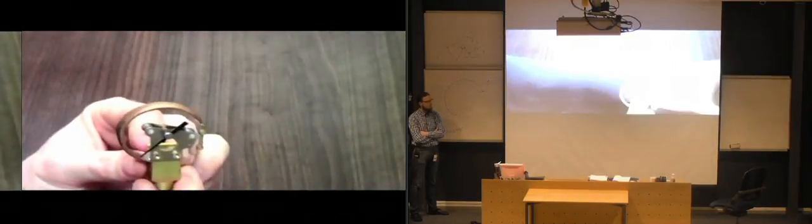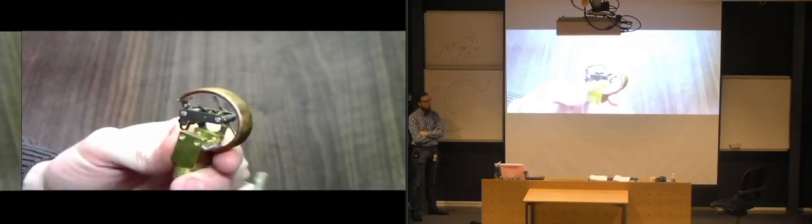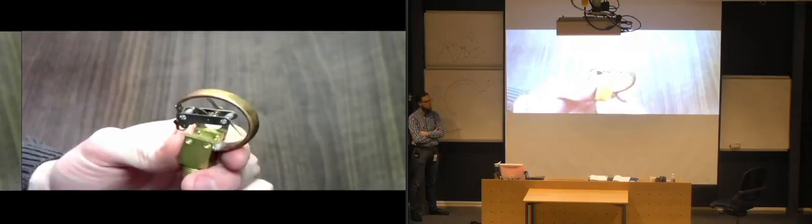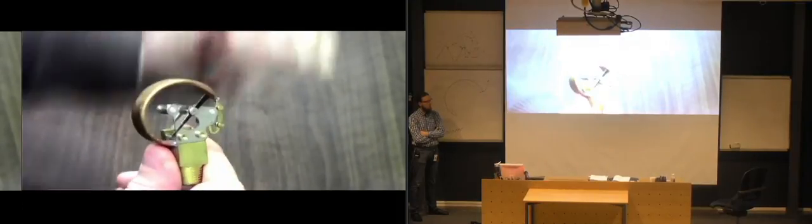For a real quick show, I'll show you the 2.5-inch dial, or this is actually a 2-inch dial. Just to show you, it's the same amount of parts, just a lot smaller, which makes these a little bit more sensitive than your more rugged, bigger dial gauges. And you still have your socket here, Bourdon tube, your sector, and then the gear connected to the pointer on the other end. So as I move the Bourdon tube, the pointer moves. And that's really all there is to it.